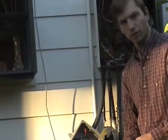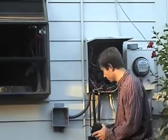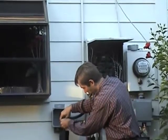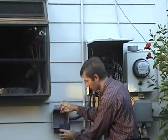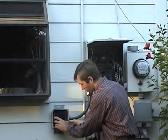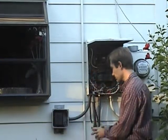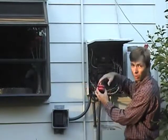There we go — now we've pulled our wire through. To complete the installation, we're going to connect the ends of the CT to the transmitter box. Put the one in the middle that's currently attached, plug this one into one of the ends, and stick our transmitter into the box. Then connect our two CTs to one of the main power lines coming in.